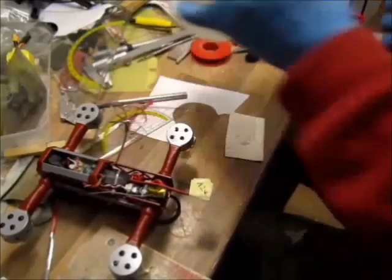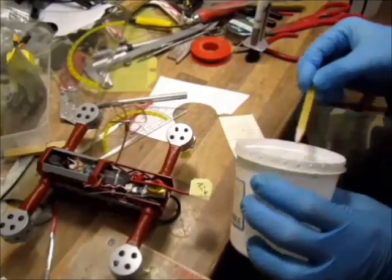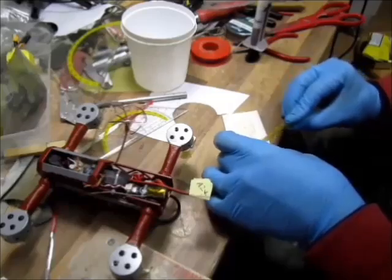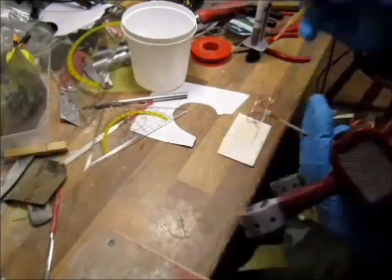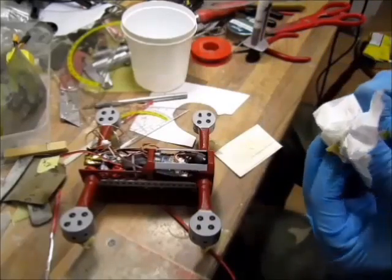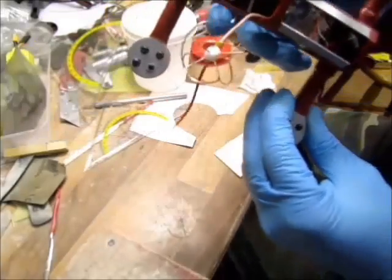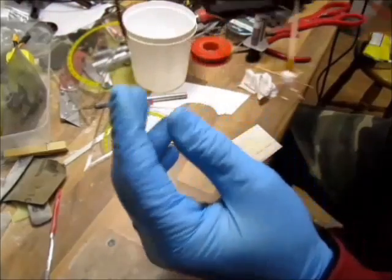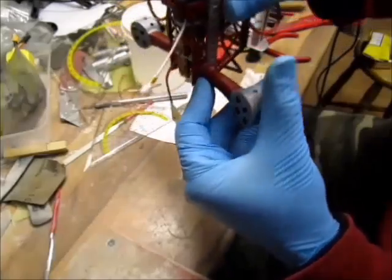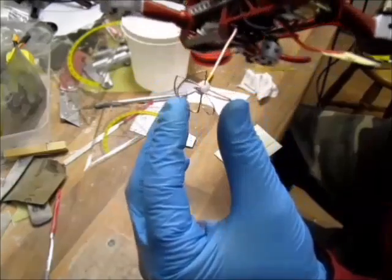Now that's still a little bit drippy, so I'm using a tiny bit of a thickener. It's like a very fine, either cotton dust, either epoxy dust, that thickens the resin and it's not as liquid anymore, not as drippy. Now that I coated this one, it's still a little bit dripping. I did it so on purpose because I'm gonna get it all smooth now. Now, here's what I have to do now. I will have to keep on rotating it for 2 minutes until it solidifies enough not to be dripping. So I will have an all nice round dot.